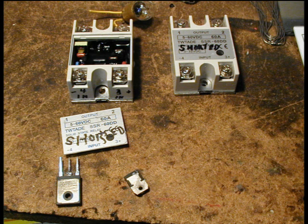So far, I have only tested it with 9 volts at about half an amp, so there's still more to do, but at least the thing works again. I won't be in a rush to get that testing done, since my new SSR protection circuit shuts off current flow pretty quickly in case the operator pulls another dumb overcurrent stunt.